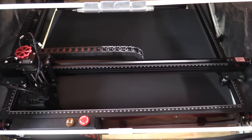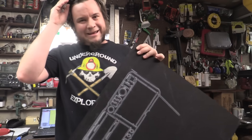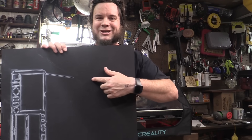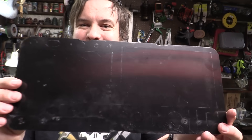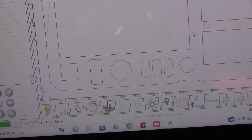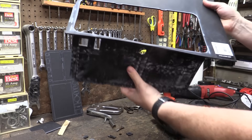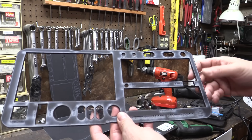I've actually run this three times now to try to get all the way through the plastic and it really didn't get all the way through. We're going to have to experiment with this some more. We also had a little excursion where the laser just decided to go off in the wrong direction for some reason — always a learning curve with these tools. That one got the panel outline but did not successfully cut through all the internal cutouts. The next attempt looks like it worked a little better — there's some soot cleanup to do, but I think that looks pretty good.